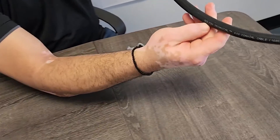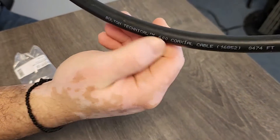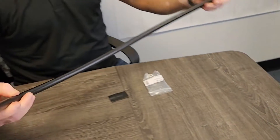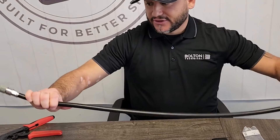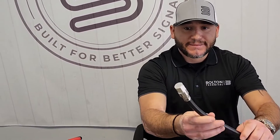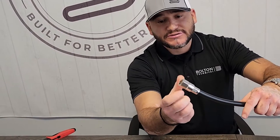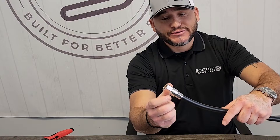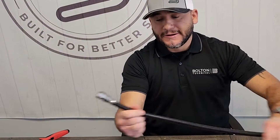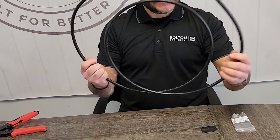As I release, you have a certified connector on the LMR 600. On the coax cable it will say 'Bolton Technical LMR 600' or '600 coax cable' — that's how you know the type of cable you are crimping. This is the correct way to prep an LMR 600 — ready for use. I'll just pop the top off and screw it on to an antenna or a coupler. The next cable will be the LMR 400.